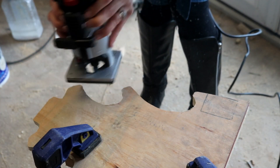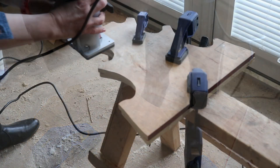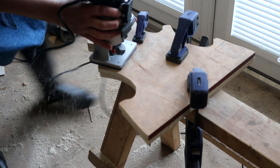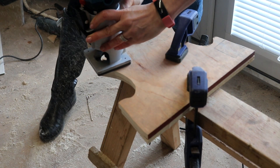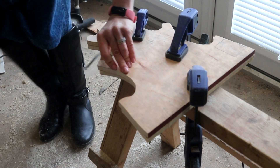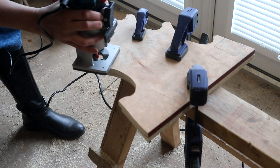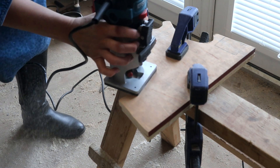The bottom straight edge is all lined up perfectly, no need to shave anything off there, and I'm running along the sides from left to right to match the bottom one. If you don't have a router, you could jigsaw both, blue tack them, and then rasp or barrel sand it. It doesn't need to be absolutely perfect for personal use, and you don't notice if it's not symmetrical when the dumbbells are on anyway.